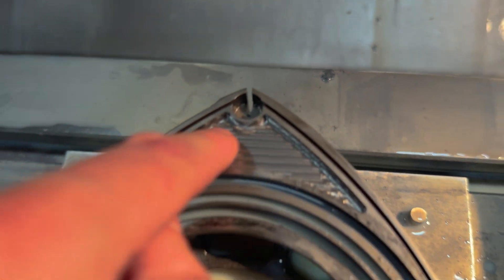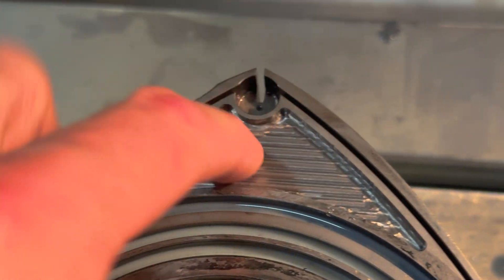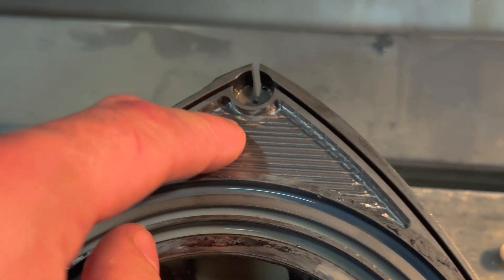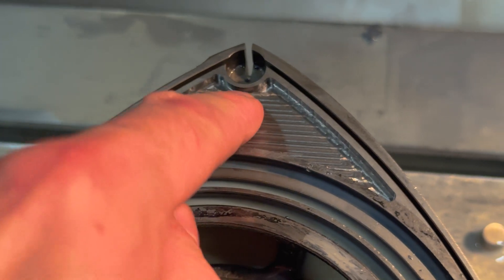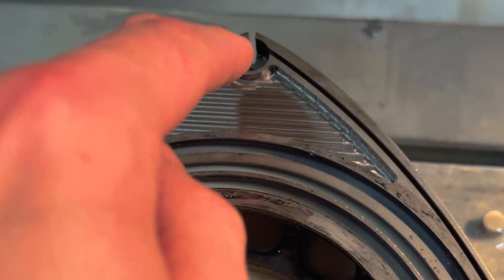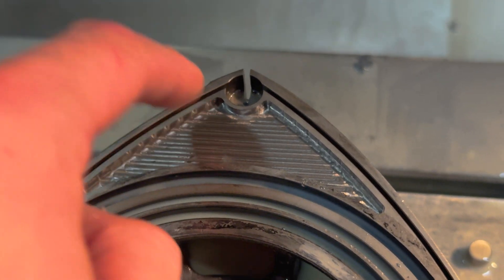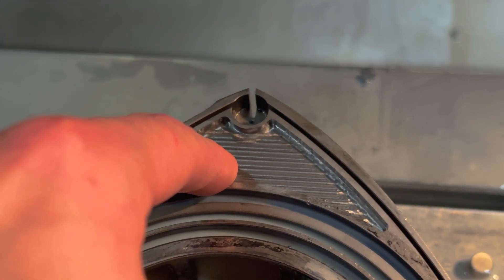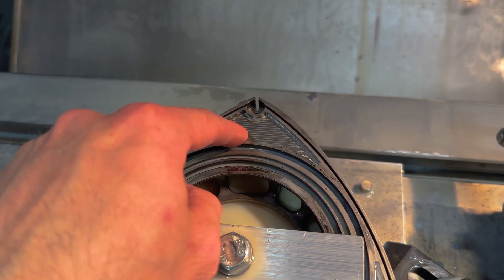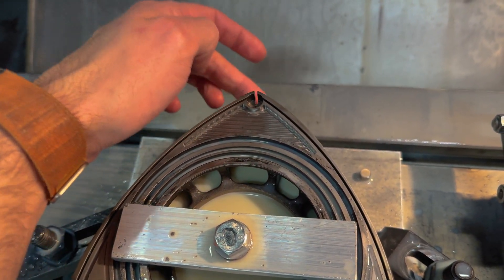The program's been remade and it's doing a lot better. This is three mil deep. I'm not sure how deep I'm going to be able to go with this, so I might cut a corner of this out on the bandsaw just to see how deep or how much material I've got, so I can see how deep I can go reliably without it going through. The next point will be actually starting to machine the slot out.